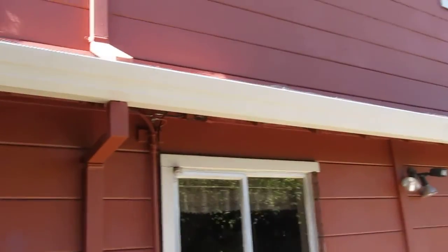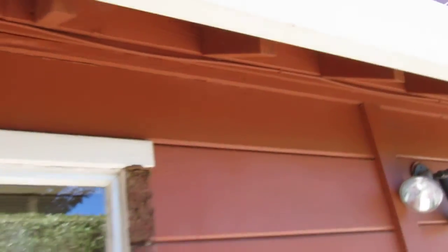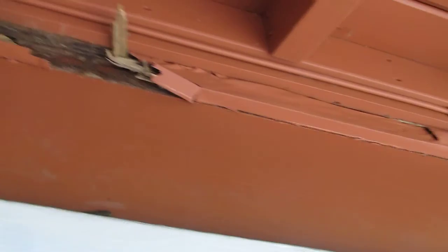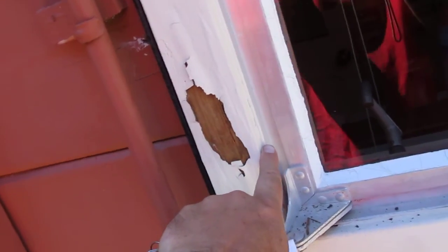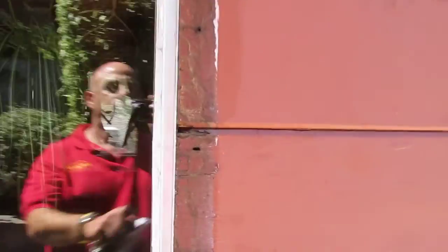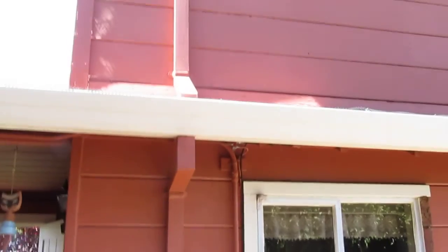What's happened is water has dripped down behind it, and that water dripping down has taken what appears to be a one-by-two strip that goes from this corner to about eight feet over. You can see where it's rotted out because it was cheap pine. The board underneath seems to be fine. The water came through and ended up rotting the trim here. We need to pull off this trim — looks like a half by maybe three inches — pull off the bottom piece, and put some two-part AB epoxy in to treat the wood. It just has a modest amount of damage. Once we open that up, put the trim back in, put the strip back in, and fix the flashing so water can't get through.